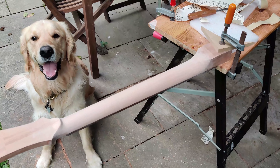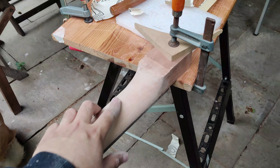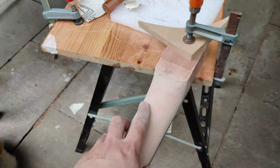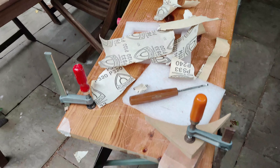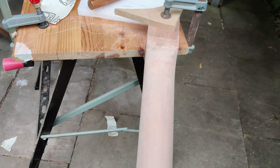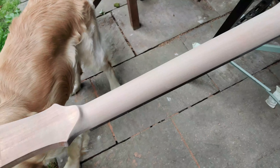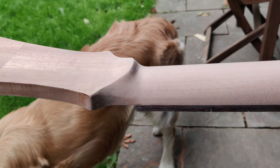I finished up with the heel — Pella is really happy with it too — and I worked to get a nice smooth transition, which was my main goal. I used a range of tools: different chisels, loads of sandpaper, files, and rasps. In the end I'm really happy with the result. It needs another sand before going into any finishing stage, but I'm a long way from that at the moment. The volute has also been cleaned up, and for my first time doing this, it could have been a lot worse.